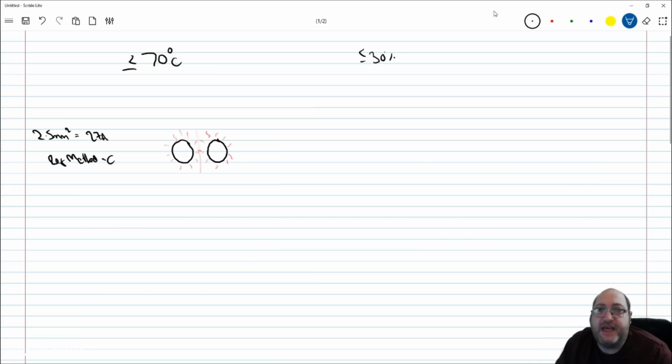It also tells us that if I have a conductor and the next conductor is 2 times its size away, so there's another one and there's another one, if you can fit 2 of that conductor between this gap, then that's fine, because there's that space there to give off the thermal losses between the 2 conductors. If this gap is narrowed or you drop one in the middle, you've screwed it up, and we've now got to group this.